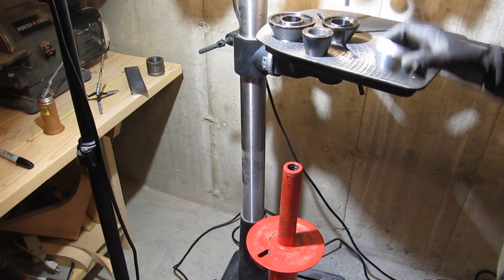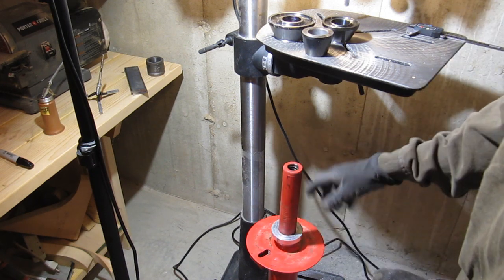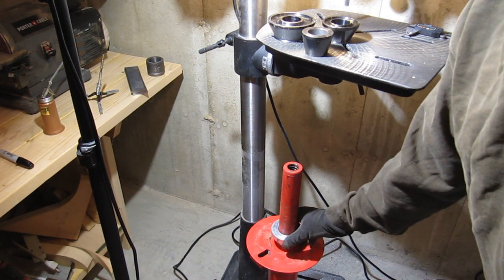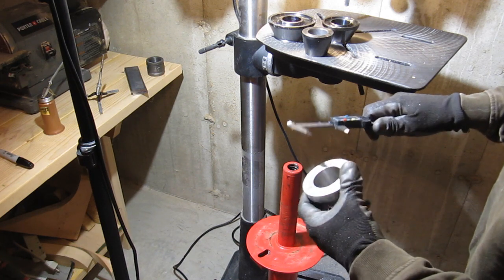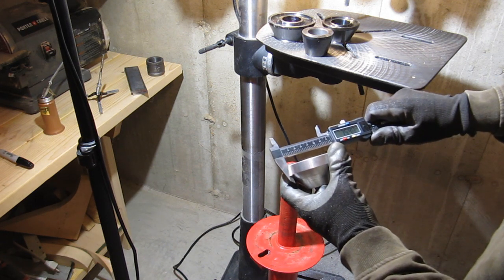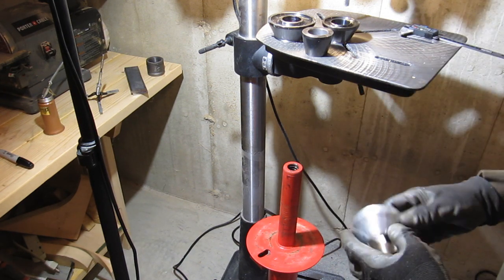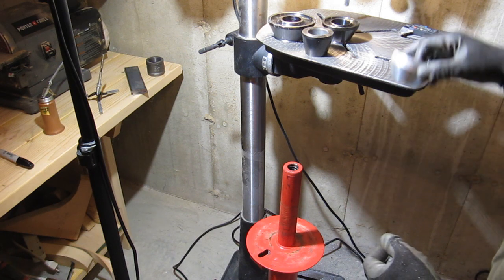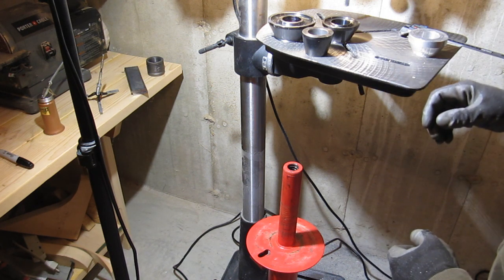The Lucid mount dismount tool comes with an aluminum centering cone that mounts on the post of the Harbor Freight tire changer and centers the rim onto the tool. Now, the issue I had was that the maximum size of this cone is about 75 millimeters. So if you've got a wheel with a larger center bore than that, then this cone doesn't work and you have to rely on the spider that comes with the Harbor Freight tool, which isn't great for centering, I found. So I wanted to get some cones that are a little bit larger bore.